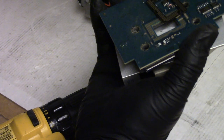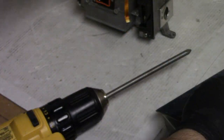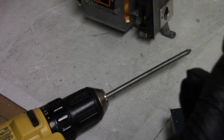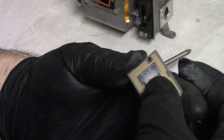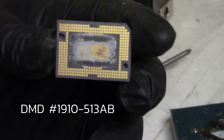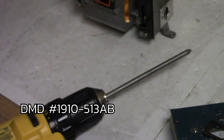Wow, yeah, oh boy. It looks like they may have damaged the carrier. This piece is so critical. If you bend any of those little tabs, any of those are bent, this thing's done. Now, luckily they're available, but, you know, don't mess them up. Alright, there's the DMD. It's going to need new heatsink paste anyway. Alright, so it is a 1910-513AB. And I'll put that in the description, actually.